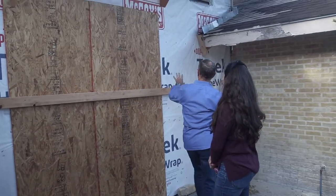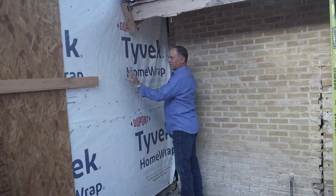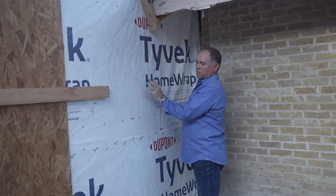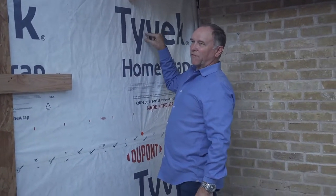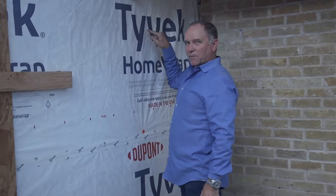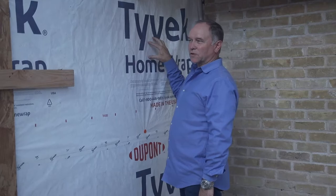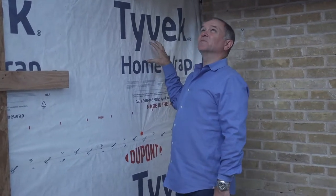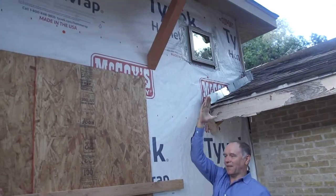There's a minimal amount of fasteners in the Tyvek — very few, because you don't have to put a lot in there. If you're going to put your brick ties on, it's going to stay in place, so that way it's waterproof. Every time you make a penetration, there's just a little bit more chance of moisture getting into your sub-sheathing, the OSB. But isn't this beautiful with the cedar and the projection and the little overhang?